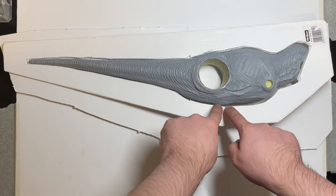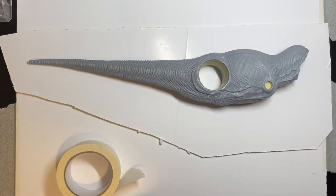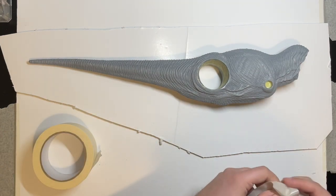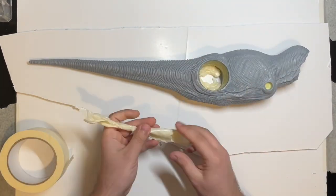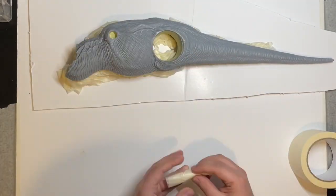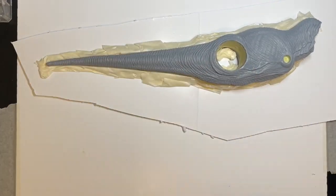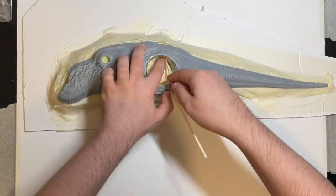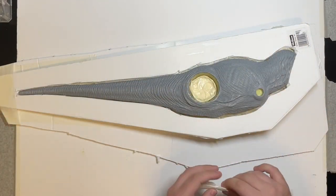Because this is a two-part mould, we're going to need to pour silicone on one half of the sculpt first, and then once one side is done, we can flip it over and do the other side. Here I'm using foam board to make the separation between the two parts of the mould — that foam board silhouette goes exactly down the middle of the figure. Now we need a way of keeping the figure from rocking all over the place, so we need to keep it still in order to help us build the wall around it. Usually you'd be using plasticine or clay, but I like using masking tape because I'm weird and it's a lot less messy. I forgot to mention to cut a foam board base on which we're actually working and sticking everything onto, but I think you could have guessed from the video.